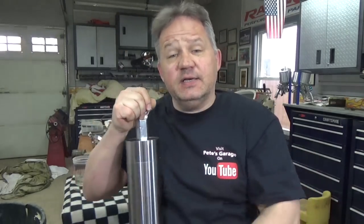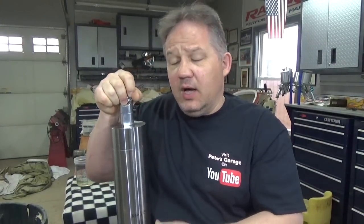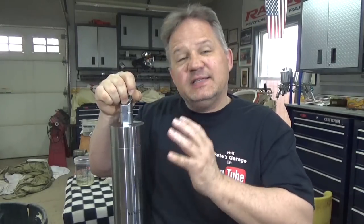The thing that makes it difficult to paint: first, they're made out of stainless steel — 316 stainless — and they weigh about 15 to 20 pounds a piece. The stainless steel is difficult because I need a direct-to-metal paint. There's a paint spec called out so I have to get the paint right on here, and that epoxy fits the bill. It's got to be safety yellow, which really narrows down your color options. Second, they're filled with damping fluid inside — not hydraulic oil, it's a silicone oil. Silicone oil is extremely slippery, and as these were being built, the silicone oil got all over the place. That's why I'm going to have to clean these thoroughly several times before putting on the paint.